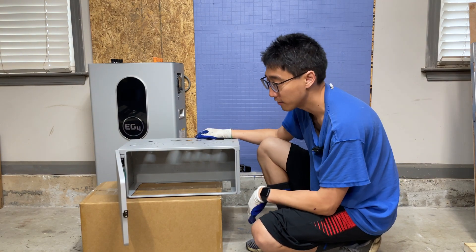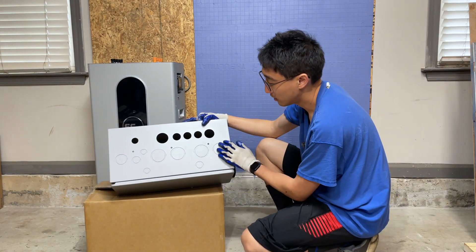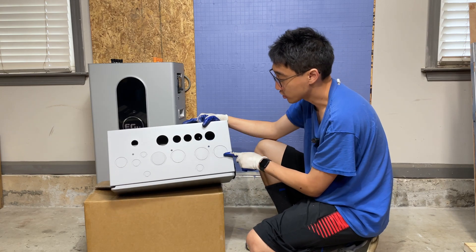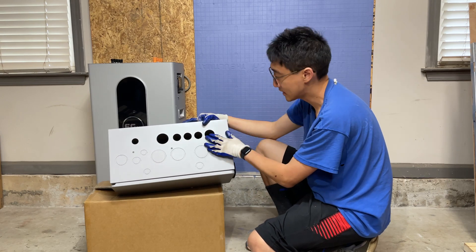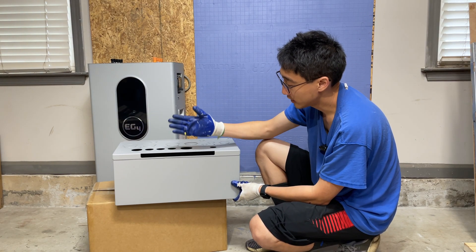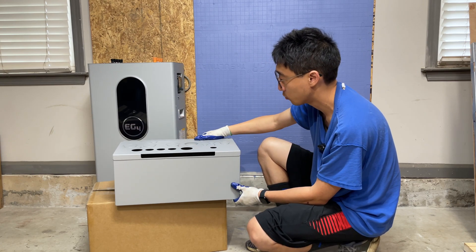In this case we're going to be using the 6000 XP. If you want to look at which holes are knocked out, the ones on the back — the entire back row is knocked out and that's set up perfectly to match with the 6000 XP. The other knockouts on the sides are still there and haven't been knocked out. There is also a little lip that they dadoed out such that the mounting lip of the 6000 XP fits in there, and you can access the screws to mount the bottom of the 6000 XP to your wall surface.